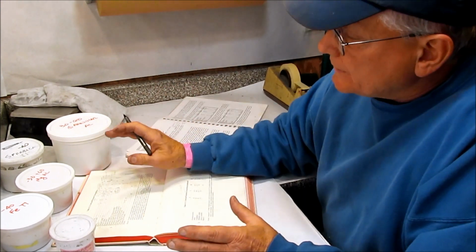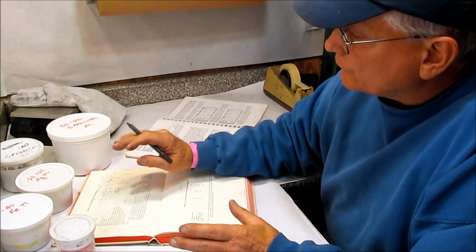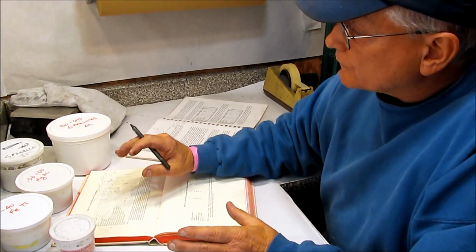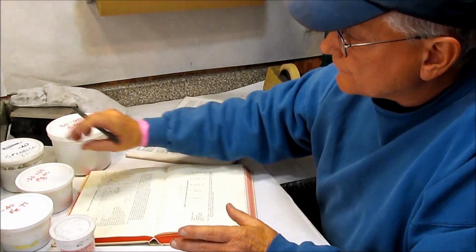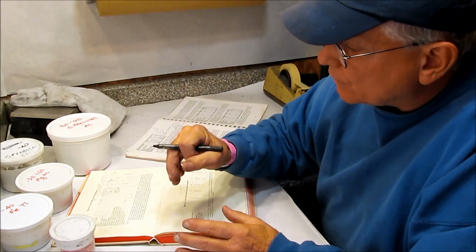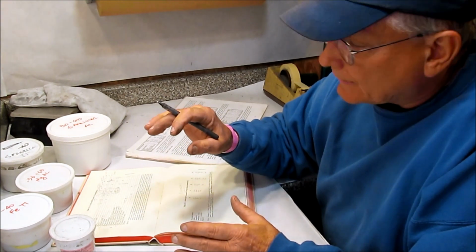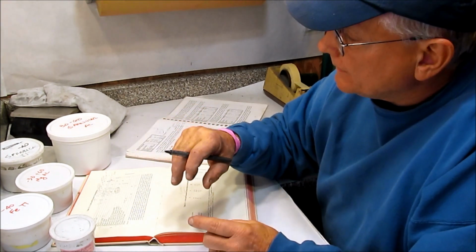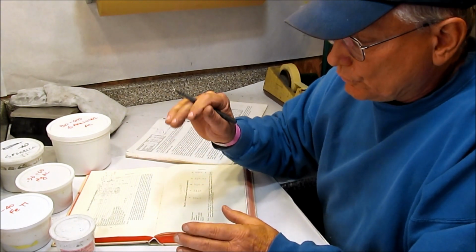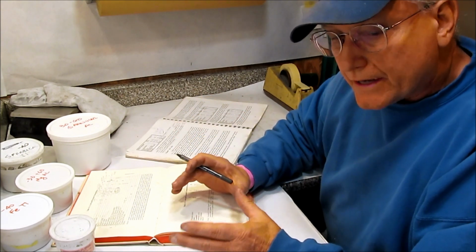I'm going to avoid magnesium completely. I'm going to use fine metals, less than 30 mesh in size. My metals are going to be a smoother shape than sponge. They're going to be spherical, little round BBs. They're going to be granular, which is just a small, slightly irregular shaped particle. I'm not going to use sponge metals.